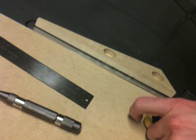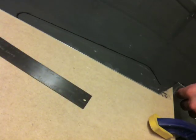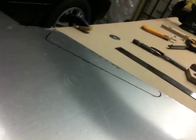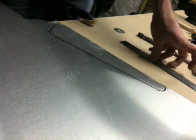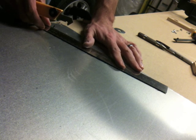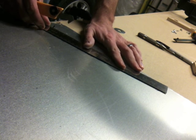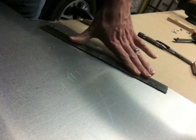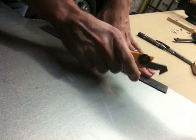Now that we've got that done, we can remove the form block and cut out our part. I'll take my ruler — my straight edge — and I'm going to score just inside of that line. I don't want to go right on the edge because I want to smooth and file it down a little bit. It doesn't have to be too perfect here since this is the flange — being off by a 32nd of an inch shouldn't make any structural difference.